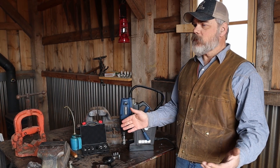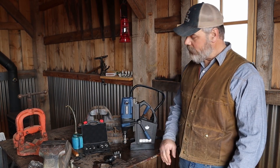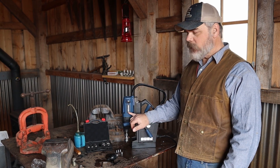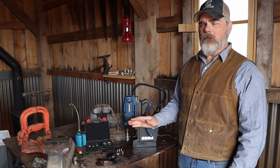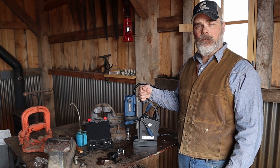It's wintertime and it's cold out, so I didn't use the coolant reservoir — I just used some cutting oil and it seemed to work just fine. The cutters cut through the steel no problem. I'm impressed with this machine. There are a few other magnetic drills out there on the market with reviews on YouTube, but Evolution — this blue tool — is pretty impressive. I reviewed one of their steel cutting saws last year and was impressed with that tool, and I'm impressed with this tool as well. This company is doing a very good job.